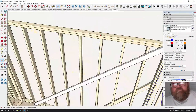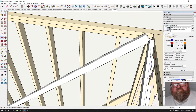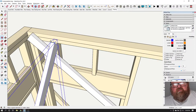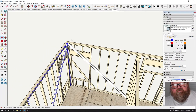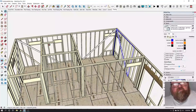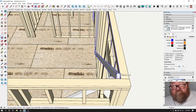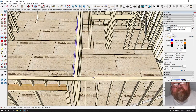The whole purpose of this is to brace the wall so that while you're setting the roof trusses, your house doesn't move around. I have literally been on jobs where we didn't brace properly, and I've been standing on top of these walls with the whole house shimmying around. I've always been a big guy — I was always a good test.